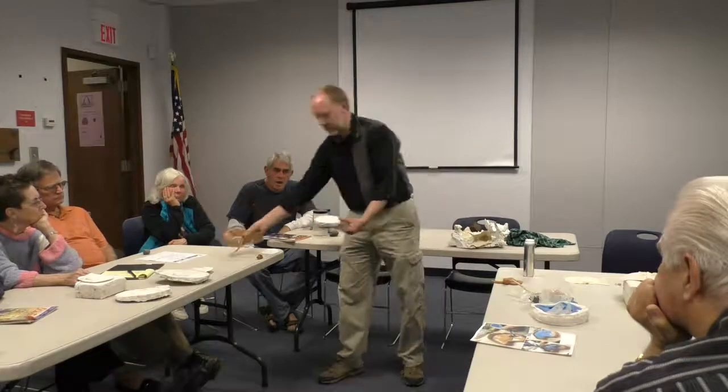Now I took the clay, added a little bit more to it, and made a slightly bigger wall around it. I should have done a better one. I didn't make it very good. And that went around there. And I made some undercuts on it, which I shouldn't have. Which way does this fit? There we go. You can see I have to push it in because I made undercuts. That was a mistake. I learned. So then I had all of this sitting here on this board, again with a new wall around it. Once the plaster's set, take that off.